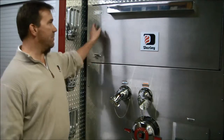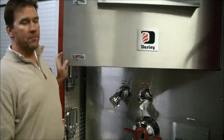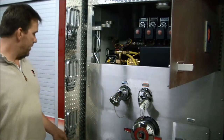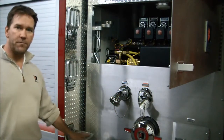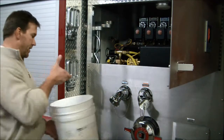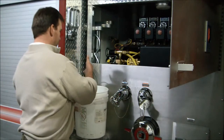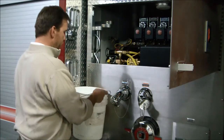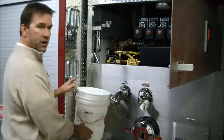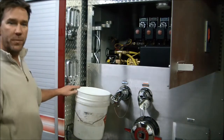We'll start by opening up the side panel on the passenger side of the vehicle where we can access our foam control valve. I always like to drop this front folding step, and then again our magical pail of fresh warm water. Pay particular attention to make sure that your handle here is pointed towards the outside so that we don't scratch up this nice stainless steel pump panel.